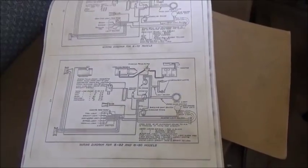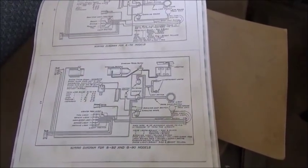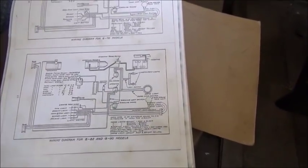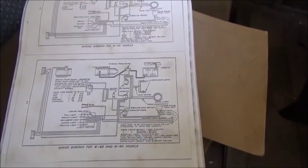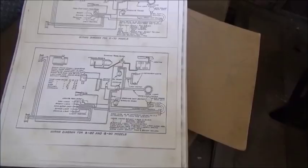That's why I'm really leery about hooking this thing up. On a negative ground car, ground should be the only thing hooked to it. We're talking about 1927 technology, totally different from new cars with electric fuel pumps. I think this gas gauge in this car is just a completely different style from what was used on later stuff. Until I know for sure I'm definitely not hooking it up. If I wanted to I could hide a gauge - get one out of a '49 to '52 Chevrolet - but I'm more concerned with it looking right than working.